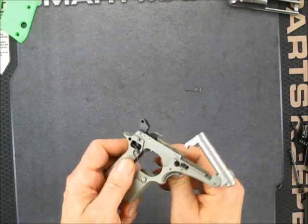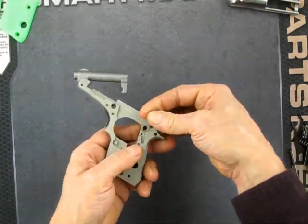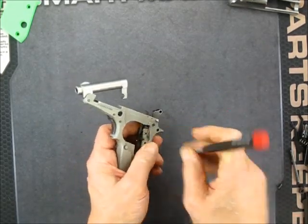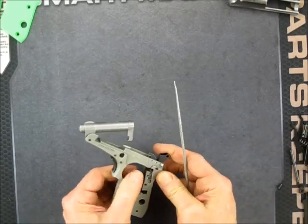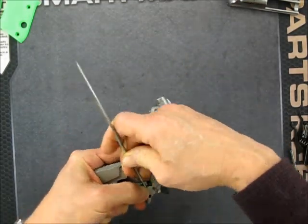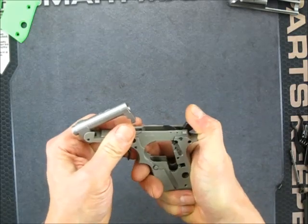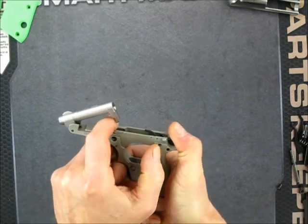Without a spring yet, but it's in place. Now we're going to put the sear spring in from the other side. I'm going to pull it down in with a screwdriver. We're going to leave that spring up a little bit, bring the sear back around, and now pull this tail up and over. Now it's in the sear. The sear should lock the hammer back. We've got no trigger connected yet, but if I pull that sear forward it'll let the hammer go forward.